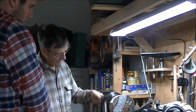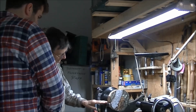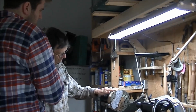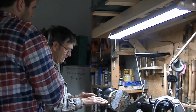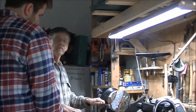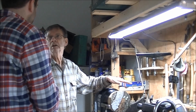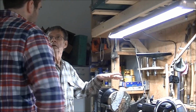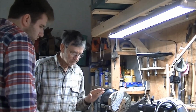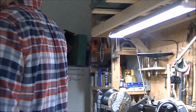This thing right here, it's called a tool rest. Okay, now, what you want to remember about the tool rest, more than anything, is when the machine is running, you never get anything past the tool rest other than a tool. You never get a finger over here, you never get nothing over here, you never reach over here and try to feel it while it's spinning. Never. That's a cardinal rule, okay? Now, the other thing is that you will, at all times when the machine's running, you will wear this. Okay.